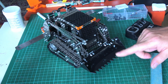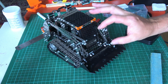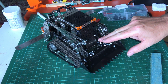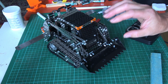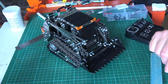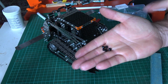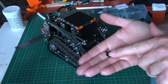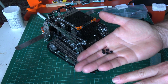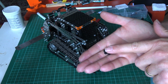Before I go on, there are just a couple of other things which I've already done to it which I should mention. The first is that while I was building it, I found that if the motors were mounted too tightly, none of them would turn, and this was in fact the case when I first tried it. And since building the model, in order to have the motors mounted firmly but not tightly and the nuts not undoing, I've made some 3D printed 3mm plastic nuts, very similar to the ones which come with the kit, and I'm using these to hold the motors on, and it seems to be quite a good solution. So when I finish doing this video, I'll make sure that I post links in the description to any parts which I design, and that will include these.